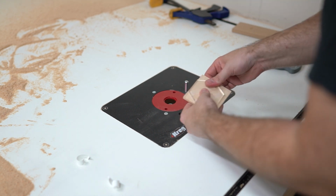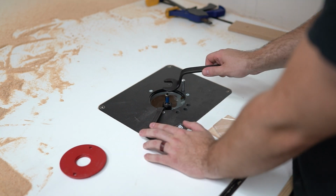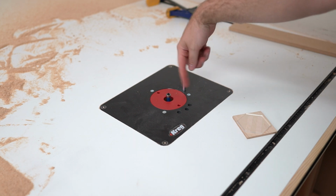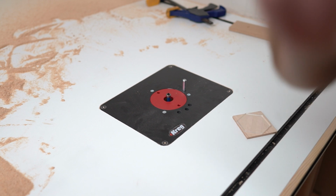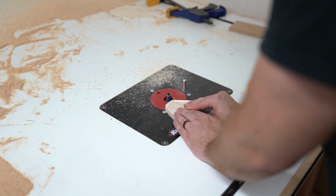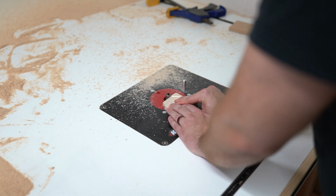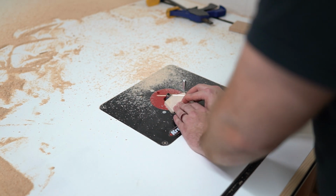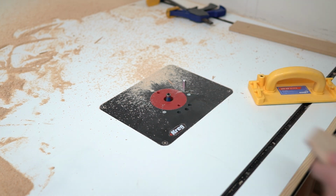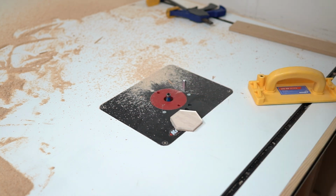And now I'm using a little template that I have for a hexagon on, I guess this is a 5mm sheet of plywood. And keep in mind the direction that your router bit spins. Your router bit spins counterclockwise in this orientation, and you want to come at it moving the piece to the left, as you can see I'm doing here. Unless you're doing a climb cut, but that's for another video. And it works really well, but Lord, it made a mess. So I'm going to be working on the dust collection system in the next video.